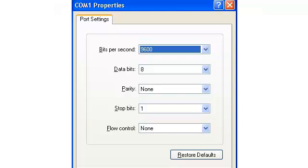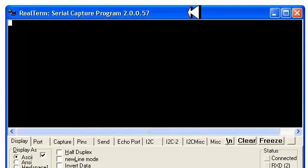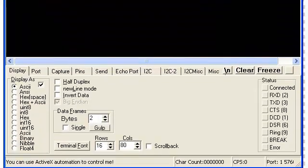Simple configuration of 9600 baud, 8 data bits, no parity, 1 stop bit, and no flow control for using it with Windows Hyperterminal. A more featured terminal program is Realterm, which is also available for use with this device.